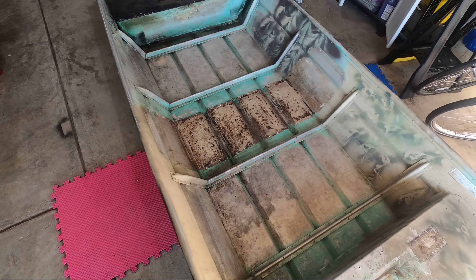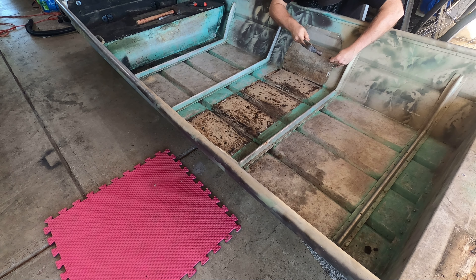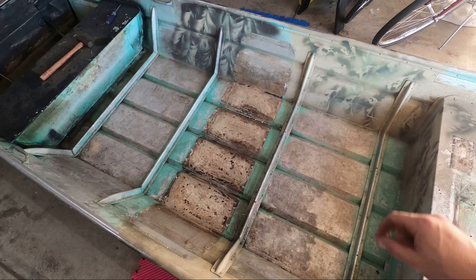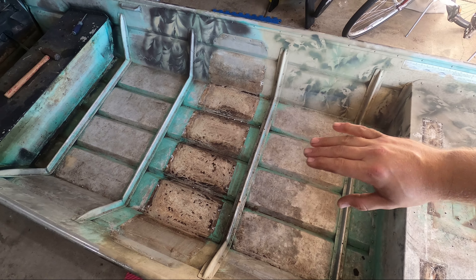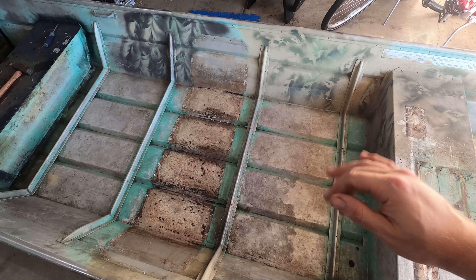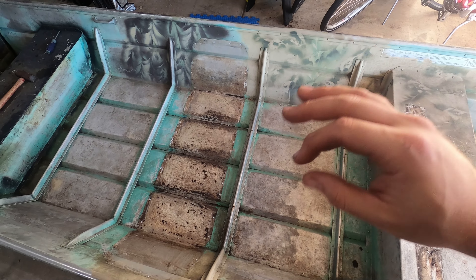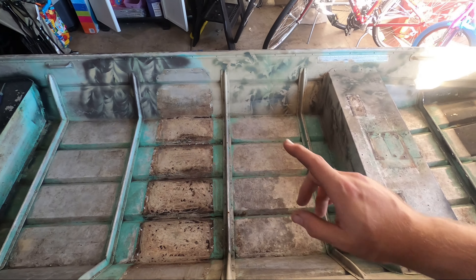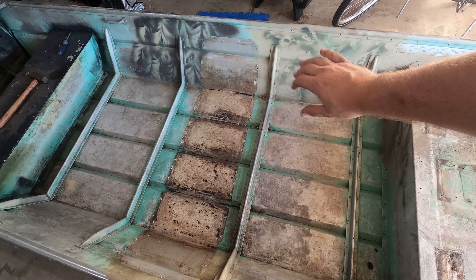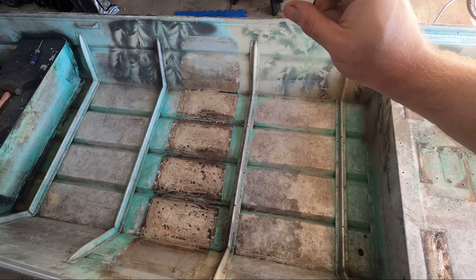Got this all cleaned up, now I'm going to start working on popping the rivet caps off. I've noticed that even though you got a clean cut of the rivet head, the actual rivet stem is still a little mushroomed and isn't just popping out easily. Punching them through did work but it took a lot of hammering and I don't want to crack any aluminum. So instead I'm using the screwdriver to shave off the top of the rivet, and then it punches right out. Definitely recommend that if you have rivets with a lot of stem left on them.